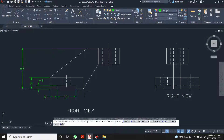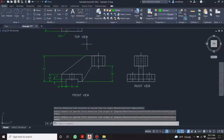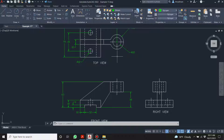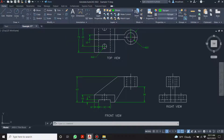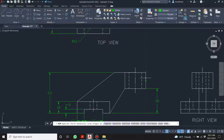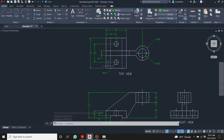32, 12, 6, 18. I'm going to put this dimension in here — from there to there, 38. Is there anything we're missing? You're not supposed to over-dimension a drawing — don't add dimensions that aren't needed. Do I need to dimension that line? Not really, because it's 63 from there to there and we have the 38, so the person just does the arithmetic. Are you going to get in trouble for adding the dimension? No — there's no harm if you want to. That's 25. I think I have everything.